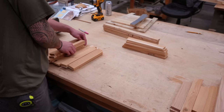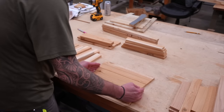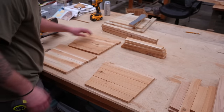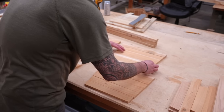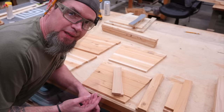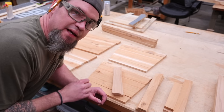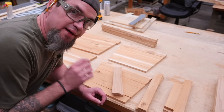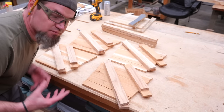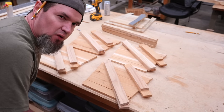While making my wall kits, a reminder that most pickets we're finding now are only about a half inch thick — I think they count the raised grain as the five eighths. For the sides, side A will be a little longer than side B, so the B panels sit inside the A panels, and we have to account for the half inch overlap on each side. Now that everything is broken down into kits, let's head over to the 720 and throw some pocket holes in the ends of some of these parts.